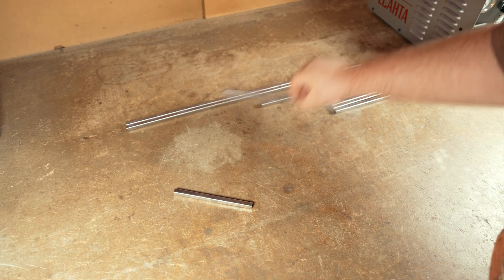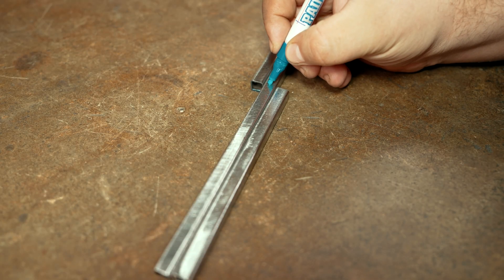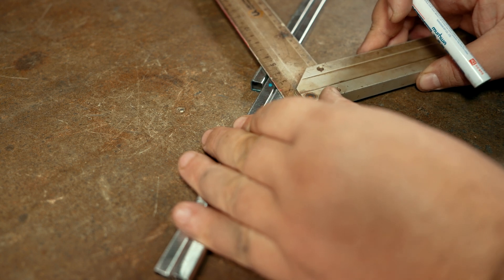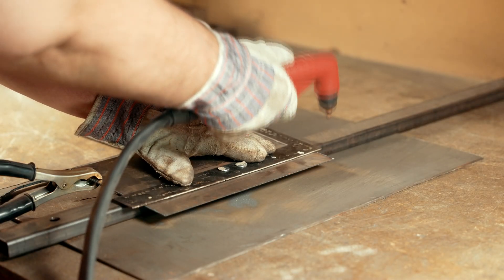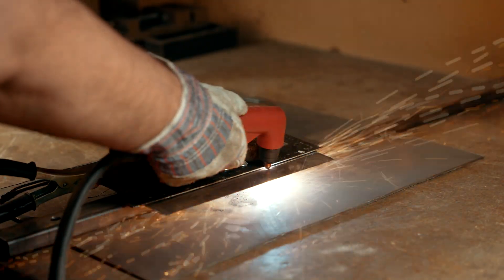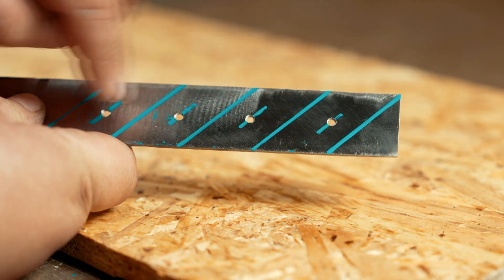The construction is as simple as possible. In the center of the middle section will be a hole for the hinge. The short side pieces will be joined together at a 45-degree angle through this hinge. You will need to cut several strips to make this joint — they are exactly the same and made in a few minutes. I drilled holes in the center of each piece for the through hinge, one strip at a time so it would be faster and easier, then cut it into individual pieces.